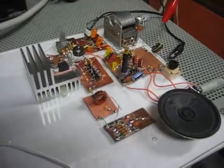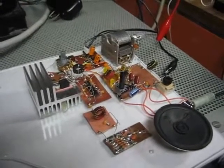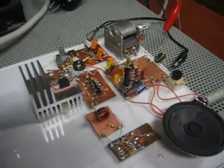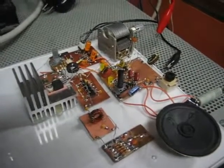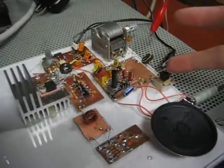This is a prototype of my new receiver transmitter design. The biggest change from my traditional designs is that this uses a tuned circuit — a tank circuit — rather than a crystal to generate the frequency. The advantage of that is that we can alter our frequency by a very large amount by adjusting capacitance and inductance.